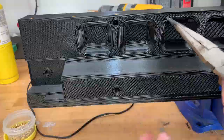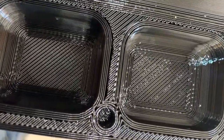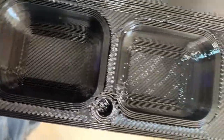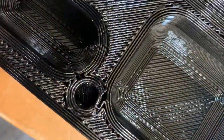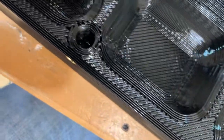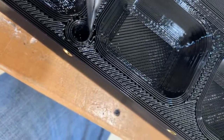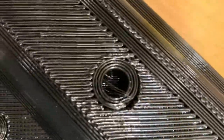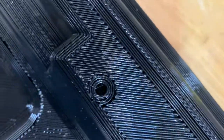That way heat can melt the plastic out to the sides, and you don't want it coming up on the inside. With these holes, same thing — make sure you've got a nice clear hole. You can see the light shining through this hole, so it's cleaned out. In this particular case these actually printed out really well, but sometimes you'll get a little stringing or a little extra piece in there. You'll want to reach in and clean it out or take a bigger drill bit and clean it out.